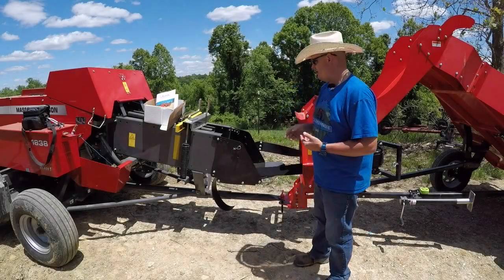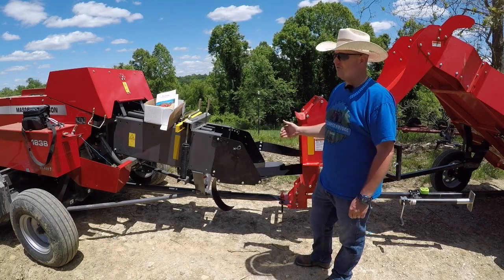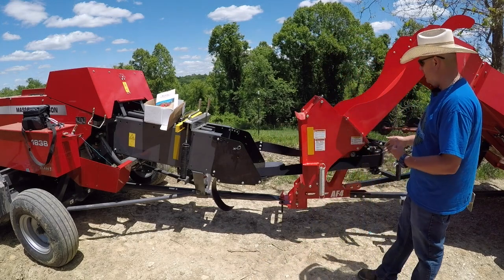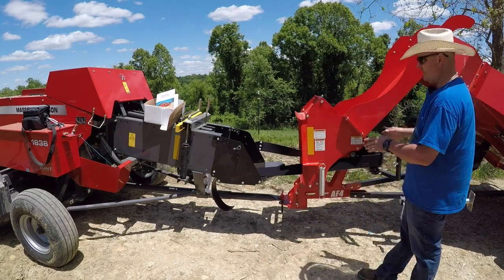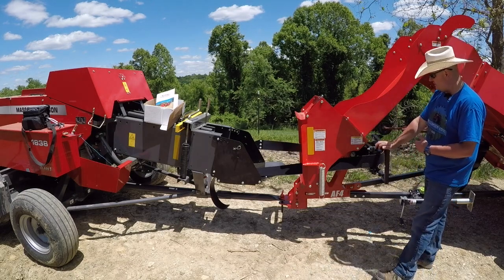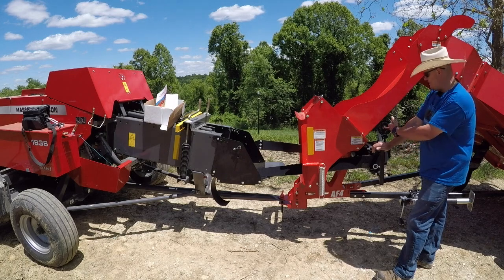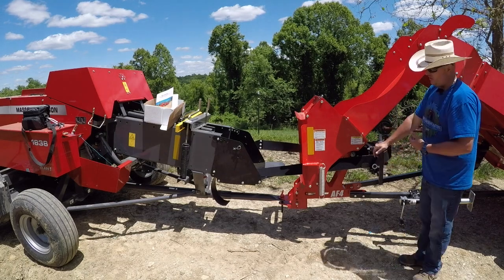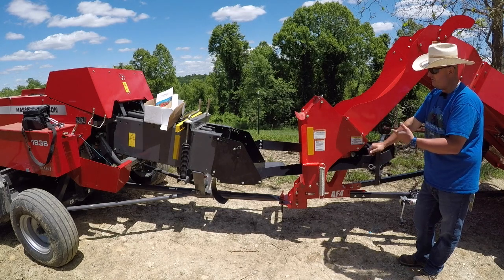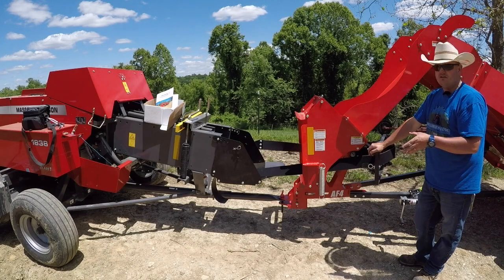What we've been doing here is trying to get this belt measured out for the right length. There are some things you have to do to make sure you're getting the belt cut to the right length. You're supposed to measure it with tension from the spring on here, measuring out at about six inches past these other rollers. It's hard to hold that and get your length all at the same time, but as long as we're relatively close it should be good.